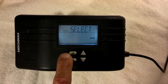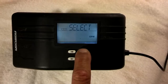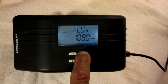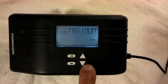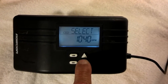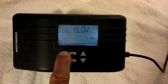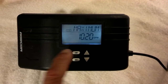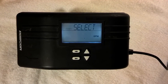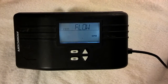This is where you can choose the maximum GPM for this PICV valve. I'm going to go ahead and hit the button up to find out what the maximum is on this valve, and it looks like it's 10.9 GPM. So I'm going to pretend the engineer is calling for something less and punch it down — there's 10.2 GPM for the maximum flow that this valve will allow. I need to clarify: this is while it's operating under the stated differential pressure ranges that we give. This valve I believe is 4.4 to 58 pounds differential.